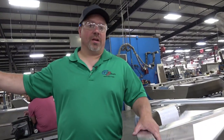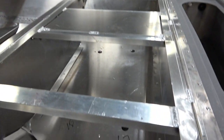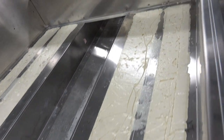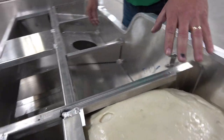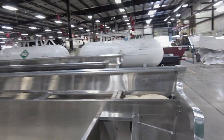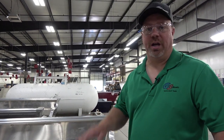After all the finish welding's done, the boat comes over to the foam area. You can see the plugs — everywhere there's a plug, there's a foam shot. There are foam stops underneath to keep foam out of areas where we need water drainage. Inside the runners, we pretty much fill them all the way up — not only for flotation but for support of the floor and bottom of the boat. Back in the rear motor well area we fill up the pods with a couple of shots, to help support the weight of the motor. We put more foam in there than needed to ensure flotation, support, and a way better ride.